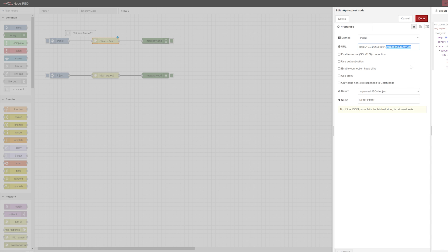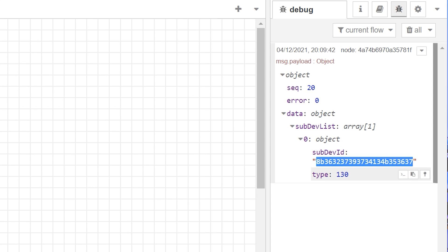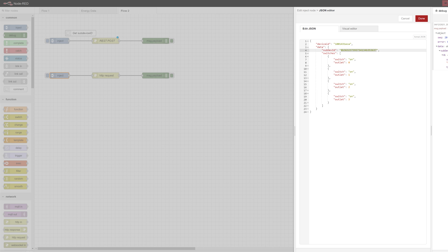You do this by sending an HTTP POST request to the device on port 8081 — that's the default port. All requests have to be JSON formatted, so you'll format your request and enter the device ID you grabbed earlier. Once you submit that, you'll receive the sub-device ID, which you can then use alongside the device ID to control and receive data from specific sub-devices. Obviously if you have more than one relay, you'll have more than one sub-device ID. I've also included a sample on how to pass a command to turn all the relays on using an HTTP request — I'll link all those examples in an article in the description.